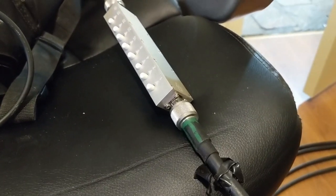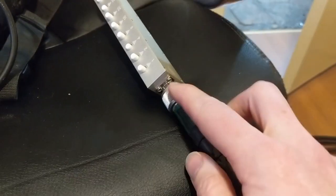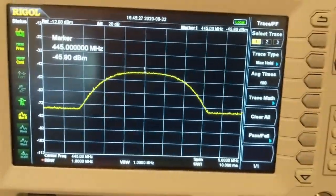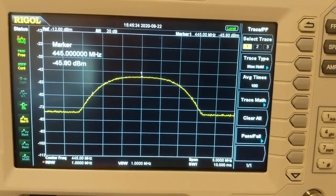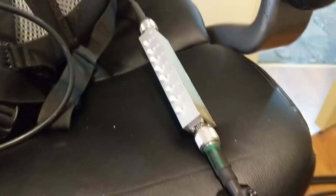So let's go have a look at the receiving system. Here we are at the other end of the coaxial cable. I've measured the power received at this end of the cable using a spectrum analyzer with a 1MHz resolution bandwidth, which is approximately the same bandwidth as the transmitted signal. We're getting negative 46dBm of signal power at the end of that coax.